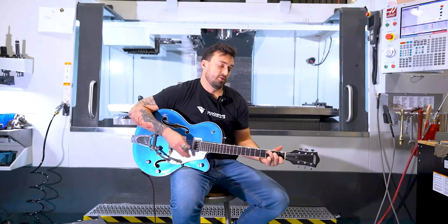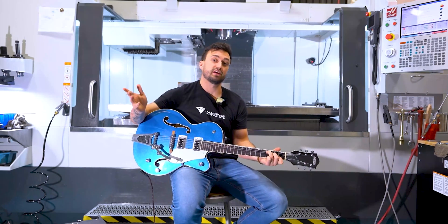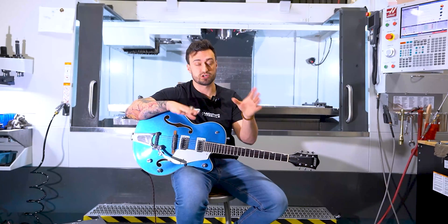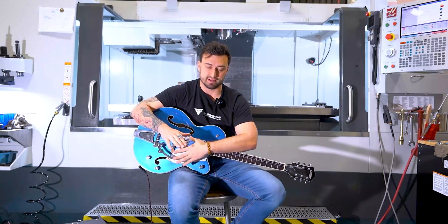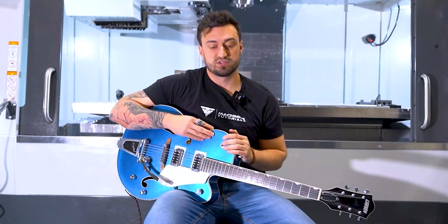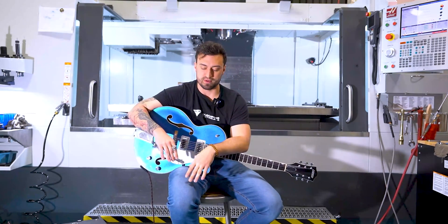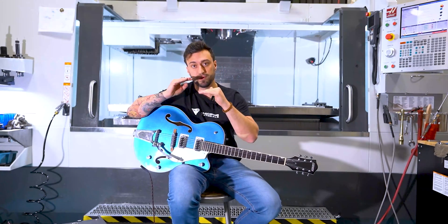Number one: go with the manufacturing recommendations. If you buy an Ingersoll or Kennametal tool, go to their website — they will have it all displayed on charts. If you're in a bind, you can also talk to a sales rep; message them on their website and just start there. I've gotten recommendations that worked great, and I've gotten recommendations that didn't. A one-inch end mill that was four or five inches long — I was told a specific speed and feed, but the rep didn't know my setup, and I ended up completely different from their recommendation. You can also use HSM Advisor or FS Wizard — plug in your tool and material and it'll help you get started.